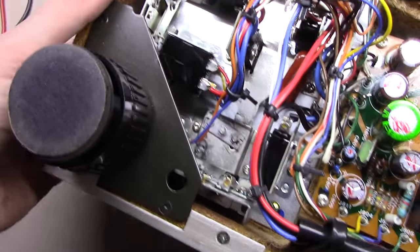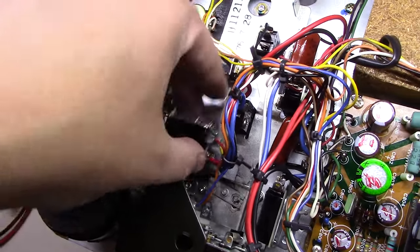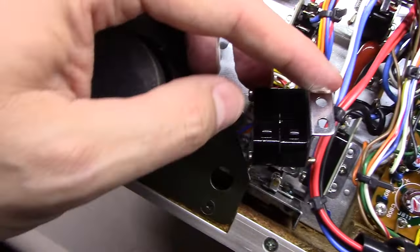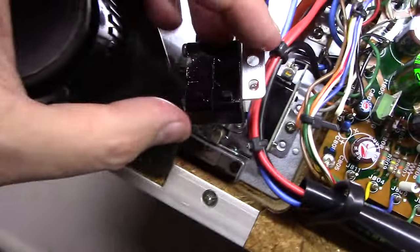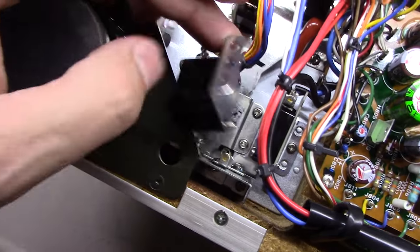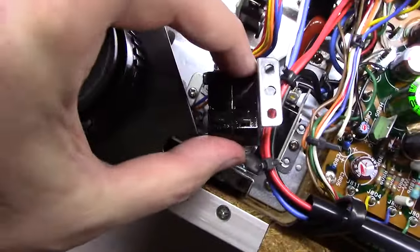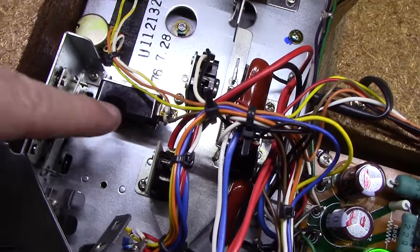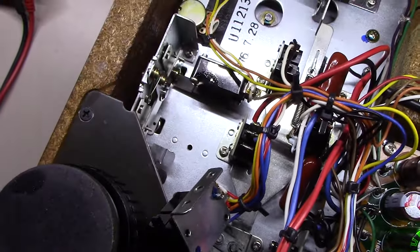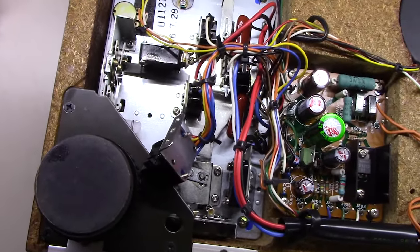These switches have a mechanical lever that pushes and actuates on the other side — these little switch heads right here. You've got to get these things turned upside down; you can see those slots — that's the only space you can get some Deoxit inside them. So I went ahead and took the screw out that held this down to the chassis so I can flip it upside down to spray inside. If you leave it in place without taking it loose, you really can't get in there to spray. You've got to take the switches out a little bit to get inside of them to clean them.